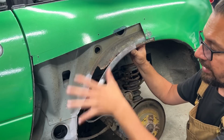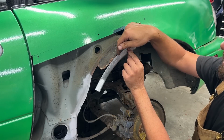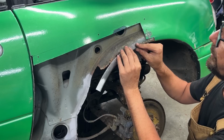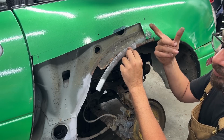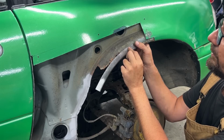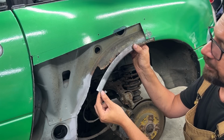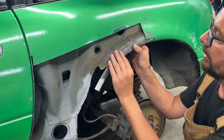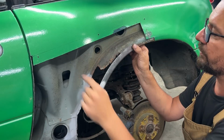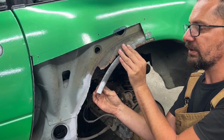That's why we have the outer fender to tell us this. So I'm gonna make a cut here, like I'm gonna cut this part away, and we're just gonna maybe tuck it in one place, just one place, so it can still pivot to go down or wherever we want to position it. We're gonna put the outer fender again, we're gonna fit it with the 3 clecos, and then from inside I can position it perfectly.